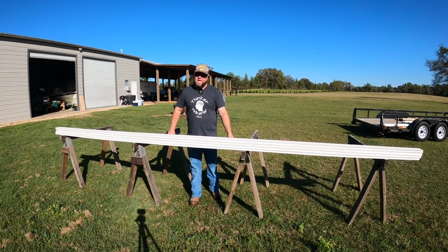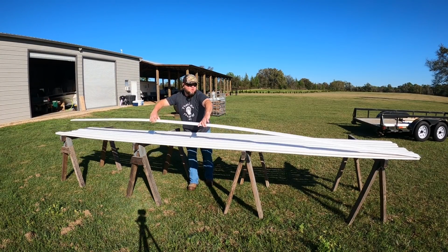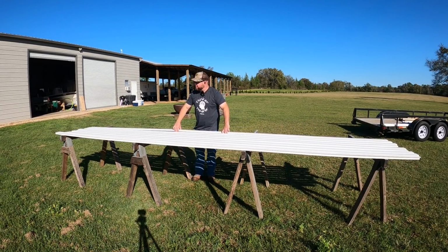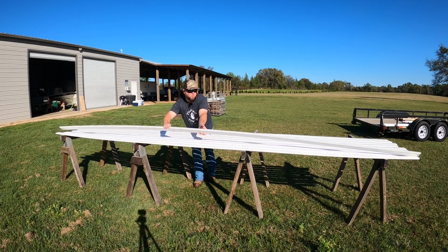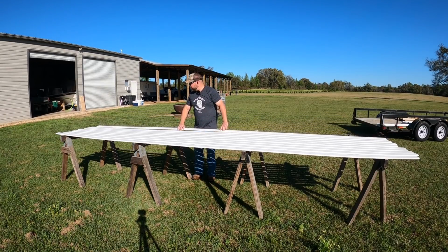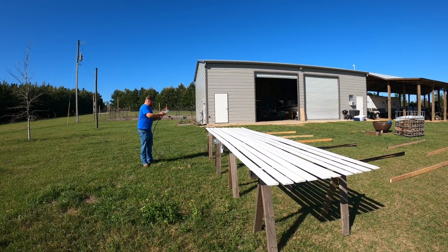Also forgot to mention, they offered MDF and this is pine trim boards right here. I absolutely went with pine. MDF loves absorbing water, falls apart. Y'all know my hatred for the stuff. And if you're gonna mop your floors or even Swiffer or anything like that sprays out a wet liquid, stay away from MDF trim. Trust me on that. It'll eventually absorb moisture, it'll flake, and it looks bad years down the road. Absolutely does. All right, so I've got my paint gun all primed up.